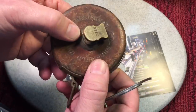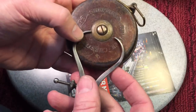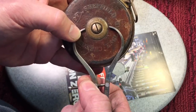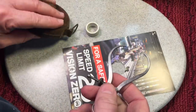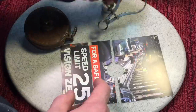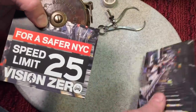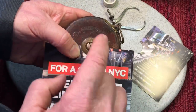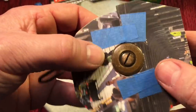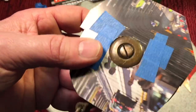It's got these two little discs here. What you want to do first is take a spring caliper — you see these all the time and wonder what they're for. You take an approximate measurement of the outside of this hole, tighten or loosen it to get the right diameter, then find something around the shop. I have a piece of tubing that fits just right. Trace that onto a piece of cardboard, cut out the circle, place it around here with a couple pieces of tape on each side. That'll protect the body of the tape measure and allow you to work on the brass without staining the leather. Now everything is capped.